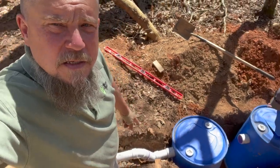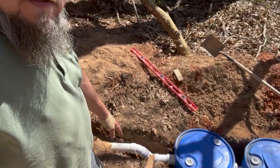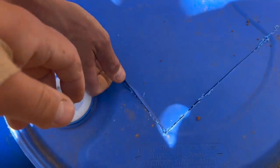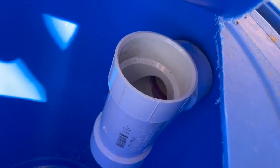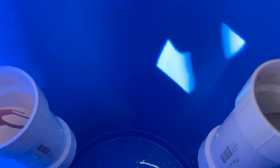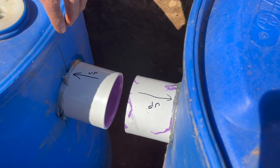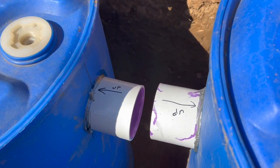We just got the first barrel connected — the plumbing coming out from the building is connected into the first barrel. On the inside we have this T where the water will go down into the barrel along with whatever else comes with the water. There's a second T positioned lower, so when the barrel fills up and overflows into the second barrel it doesn't back up into the first pipe — it just flows down. These arrows with the word 'up' remind us to keep the T straight up and down, confirming it's correct.